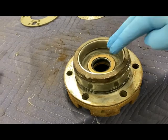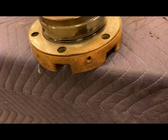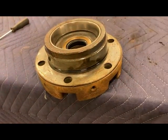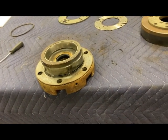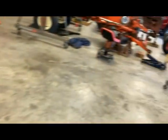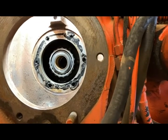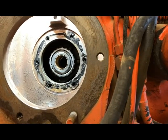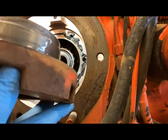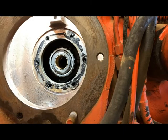Following the time-lapse, I went ahead and put our new seal in, got a new o-ring, and got our shims back in place. The really only thing you've got to watch when you reinstall this is this hole right here — this is a weep hole in case that rear seal goes bad. Oil will drain out through this hole and not go against your brakes, because then you wouldn't have any brakes. So I've got everything ready to go. Let's head back over to the tractor. I've cleaned that area up, lubed up this o-ring with some Lucas assembly lube, and we're going to slide this mechanism right back in, making sure our weep hole is in the down position.